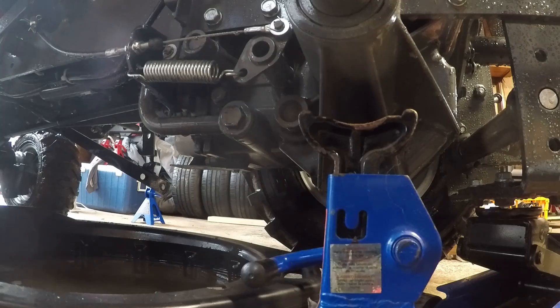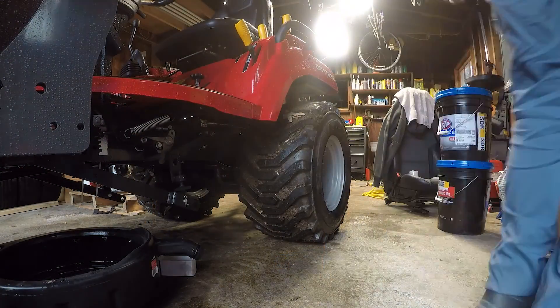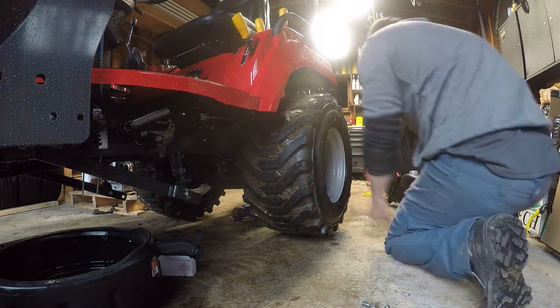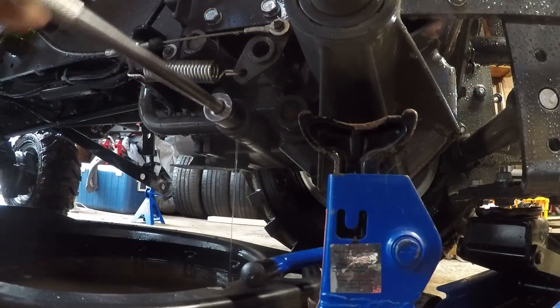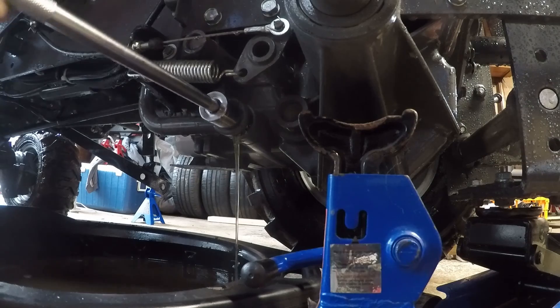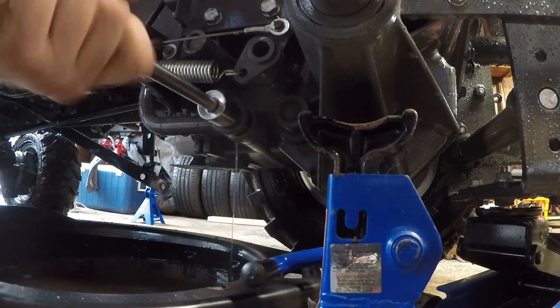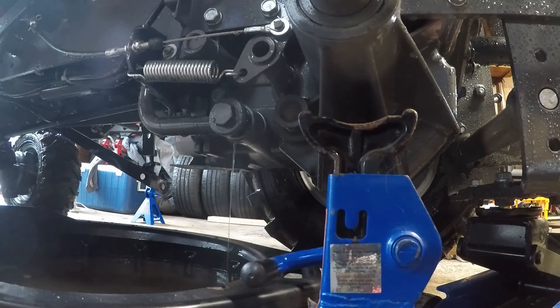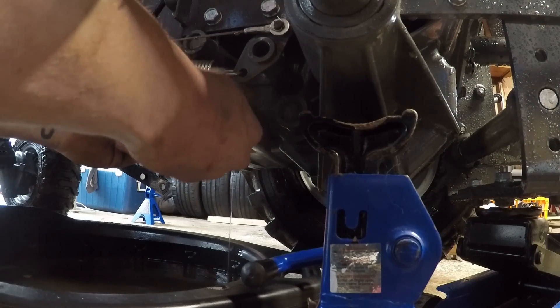To access the suction filter, you will need to remove the left wheel. Warning: if you have any type of rim guard or ballast in your wheel like I do, this will cause the wheel to be very heavy, so just be careful when removing it. After you remove the wheel, you will have a clear shot to the suction filter. Go ahead and remove the filter. Ensure you have your drain pan in place, since there will be residual hydraulic oil in the filter. When removing the filter, be careful not to lose the o-ring on the other side of the fitting. If it is not properly in place, it will cause a leak.